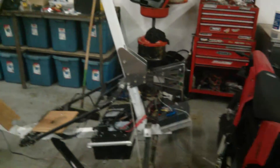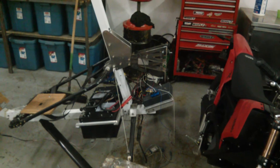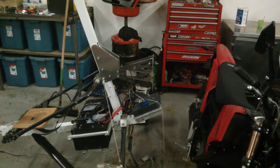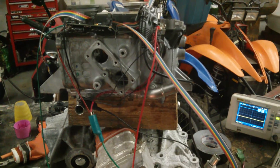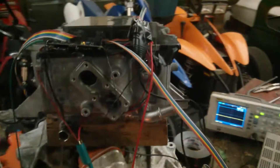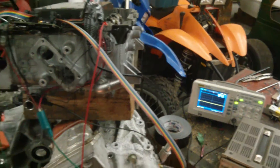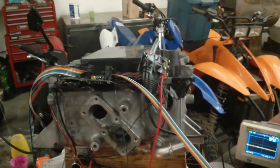It's a lot better than something like the Sevcon that's on that ultralight I'm building. The Sevcon actually uses the same sensor because it's a UVW type from Korea — one of those Korean Sevcons that are for sale. Basically you've got to set the degrees timing and mess around. You've got to swap UVW. You've got to get your encoder versus your phase wires all correct. Well this one, you just push that button and it memorizes everything and you're done.